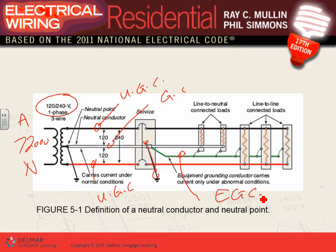Any comments, guys, about this circuit? You should understand that these are two different types of loads. These are connected to 240. This is your range in the residential, your dryers, electrical ranges, and AC units. They will be connected between the two hots. These are all your receptacles, your lights, your bathroom fan, and all the 120. Does everybody understand that on a 240/120 system, you can deliver two voltages to the appliances, 120 and 240? 120 is for the smaller loads, 240 is for the bigger loads.